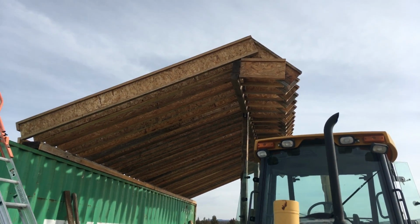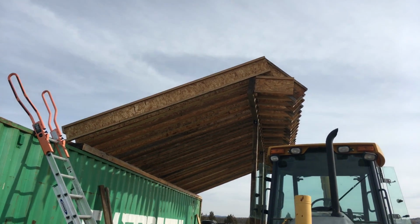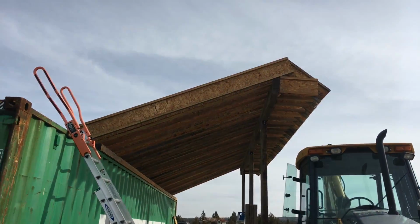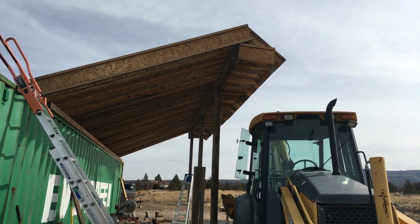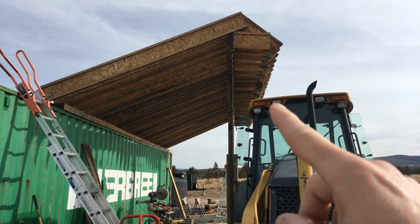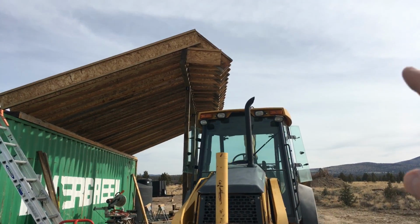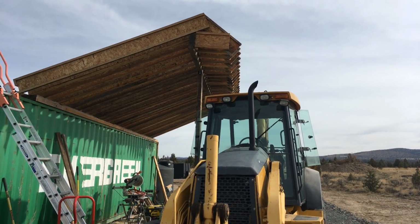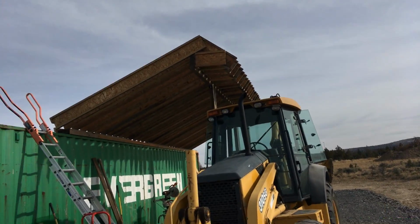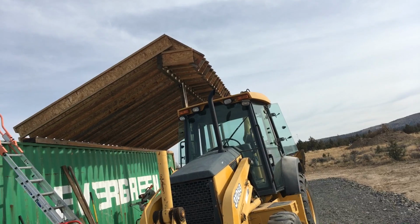The kind of funny thing about this whole setup is my beams there are a little twisted, whatever. But the way I put this all together, the twist kind of translated out, and then up here on the ridge line as well a little bit, which is not a big deal because when I put the roofing on it, I can adjust all those that are out a little bit from the twist in, and then it's all going to be screwed together.